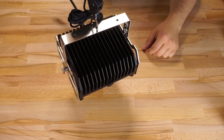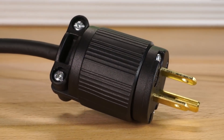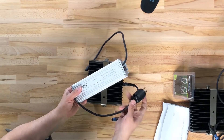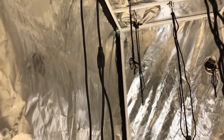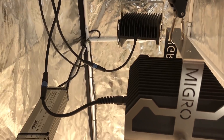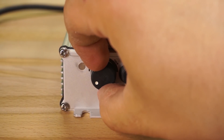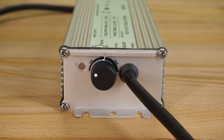I think these brackets would work great for fastening these lights to a piece of 2020 aluminum t-slot extrusion. The driver came with a North American style plug on the AC side and one of those waterproof threaded connectors on the DC side. The AC cable is pretty short, meaning you'll need your driver within a foot or so of a plug, so you may need an extension cord. The cable on the DC side is also short, but you get an eight-foot extension for driver positioning flexibility — though it would be nice if the AC cable came with an extension like you see on HLG kits. On the side of the driver is a built-in potentiometer rated to dim from 100% down to 10%.